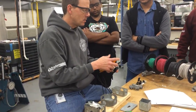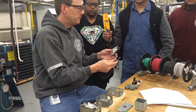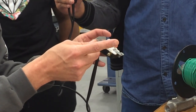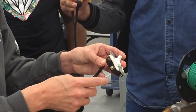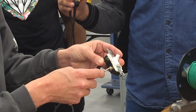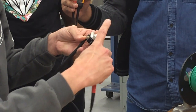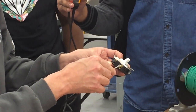I take the meter and put it on the common terminal. There's no on or off with these three-way switches — it doesn't say on or off anymore. When the switch is up, the common is going from here to this screw — hear how it tones? And then when I flip it down, it's not to that screw anymore; it went over to the other screw, the other pole.